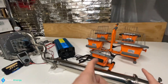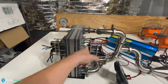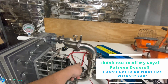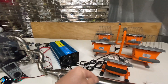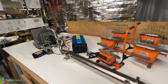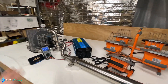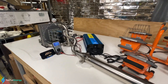Got a pretty simple setup. The turbine is geared up to the generators at a 46-to-15 gear ratio. The three-phase high-frequency four-pole generators are rectified to DC to go into the inverter, which puts it to 120 VAC out — it might be about 115 to 120 VAC out. It'll go in at a little over 12 volts. I've got a timer — a clock right here — so we can see the actual time that's gone through each test, so there's no fudging in the speeds of the film.